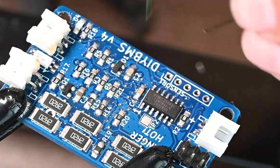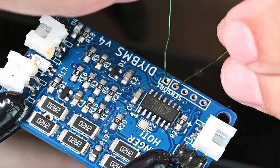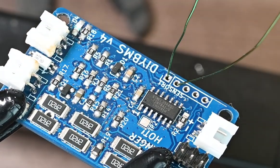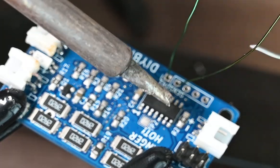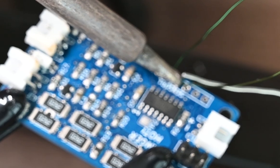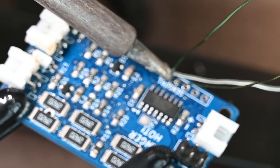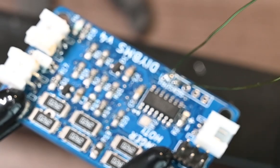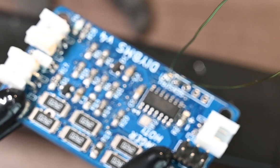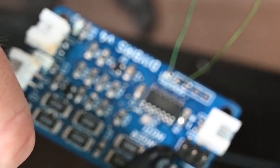So what you want to do is put it in the first sensor, the one that's got a square on the end, and then the next one to it, which just has a round end. And I didn't show it here, but I did scrape the ends off. Make sure you get the enamel off. And it just takes a dab of solder. And that is it as far as attaching it to the board. Now I will go out there and hook it up, and I'll come back in and show you what it looks like